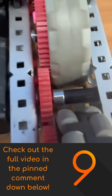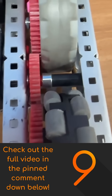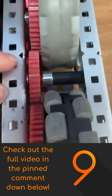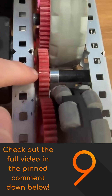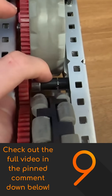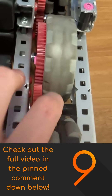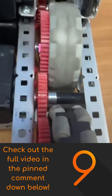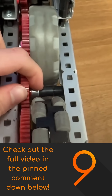Three-hole gap is finicky, and there are a couple of little quirks for each different RPM. For 360 RPM, what I have done here is pretty standard: you have a washer in there for spacing, a gear, a shaft collar, and then spacers. That spacing was done in CAD models to be pretty precise, and the shaft collar stops the shaft from wobbling out. I only need one shaft collar on that side, because since it's spaced properly, it's not going anywhere.